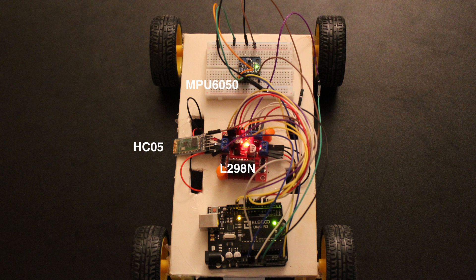I have four DC motors, which are 2.4V each, connected to an L298N H-bridge motor driver. This makes sure that the Arduino does not get too much voltage input, because it acts as a voltage regulator. These are all connected to an Arduino Uno microcontroller — I am using the ATmega328P.